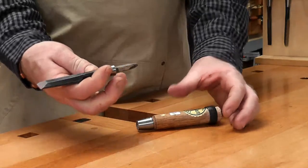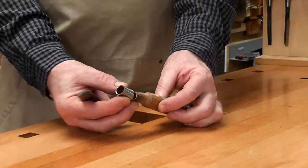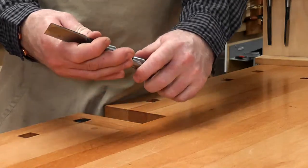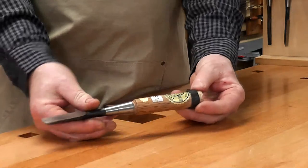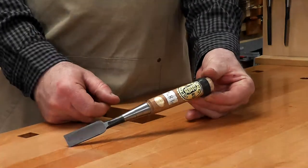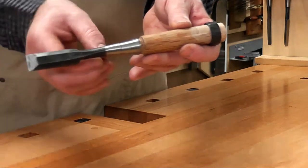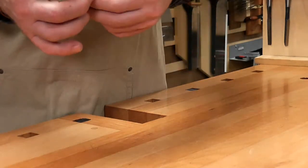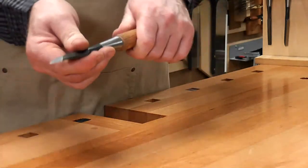The chisel has a bolster that fits up inside the handle. That tapered ferrule almost acts a bit like a collet. So the more you use the chisel and it's putting pressure down, it will lock it in place. Now, one of the problems I can get occasionally, I get them back, they have a crack line around here, because as you use this and they blend this in the factory where that ferrule is, you can't see it. Tap it together, it won't come apart.